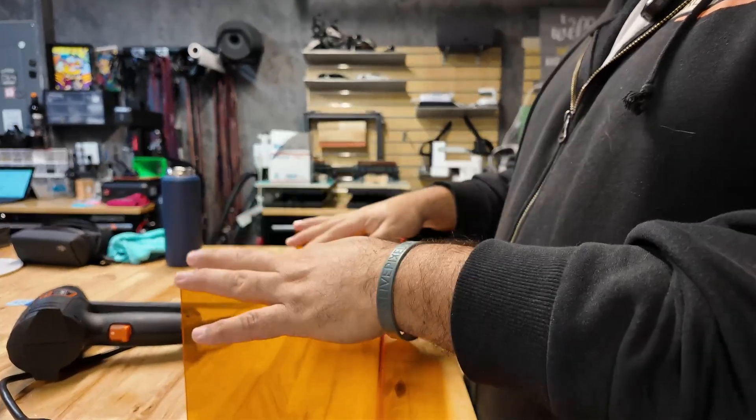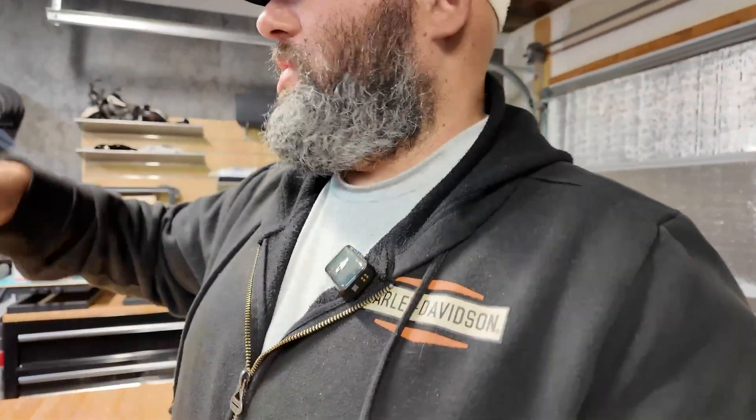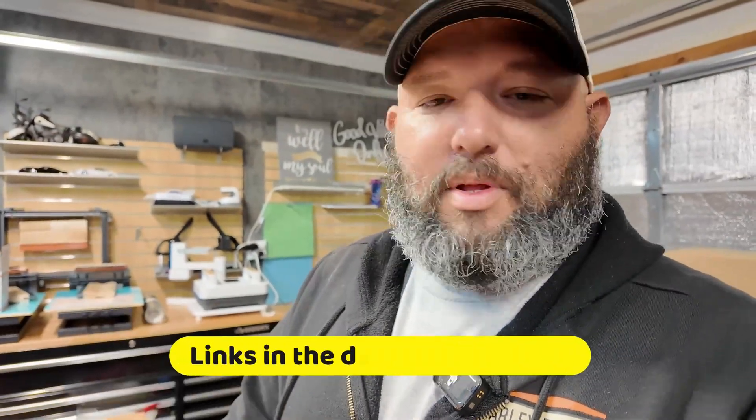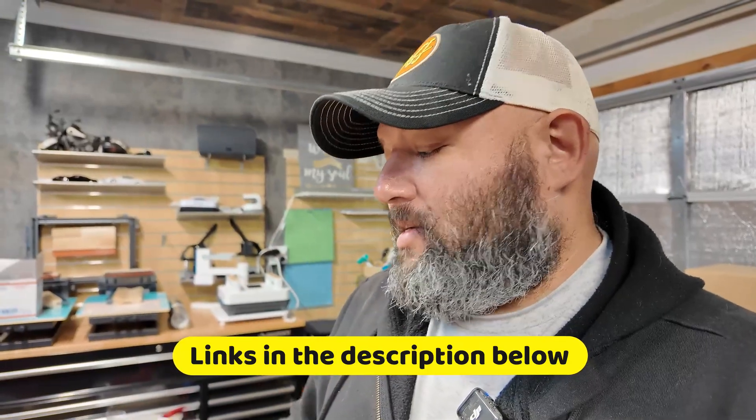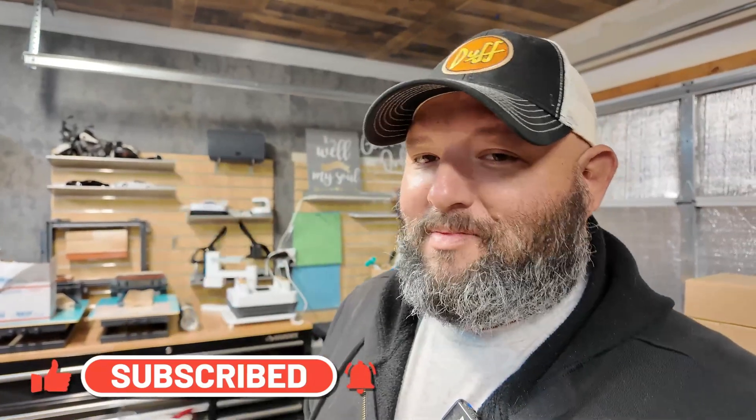If you get a thicker acrylic, it will be more resistant to temperature, so your heat gun needs to be stronger. Super easy to make a laser shield. So if you have a fiber laser, a cone marker, an X2, F1, or F1 Ultra and you need to leave the shield a little bit open, you can make an extra shield to protect your eyes and the family around you. It's a really easy project — prices for the acrylic go all over the place, but I'll put some links below. Just get a heat gun and you can get this done in a couple of minutes for really inexpensive. Please leave me your comments below, give us a thumbs up, subscribe, and as always — fire the laser.